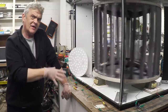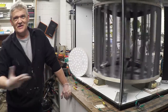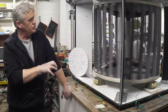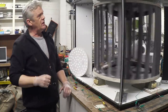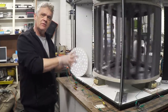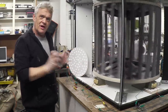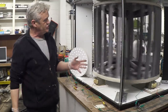I've got four coils. I reckon I can get six in each section, so I want 24 coils all the way around. I've got a collection of 20 coils but I'll get those collected and put on there — that's going to give me about 72 watts. An estimate of the speed is around about 10 revolutions per minute. Of course we have to get this in the wind; we're doing this off the blower because there isn't any wind, but still extraordinarily convincing results.